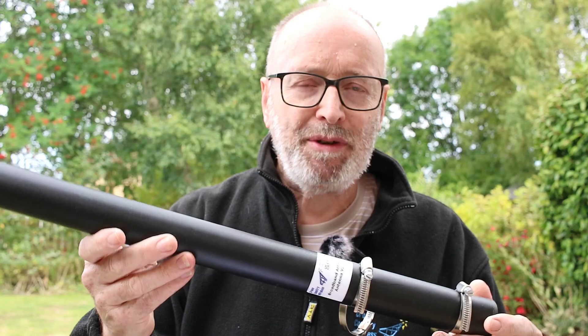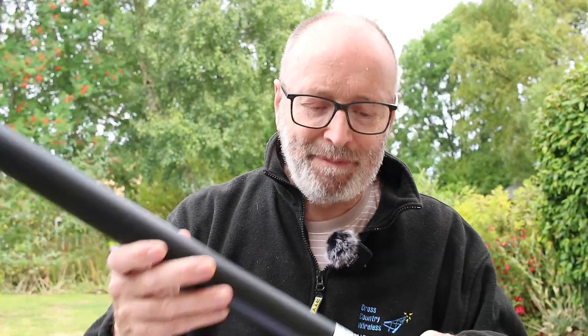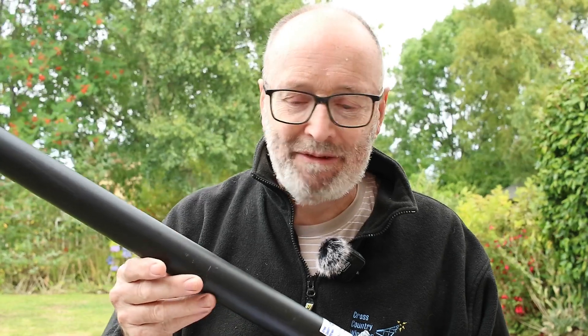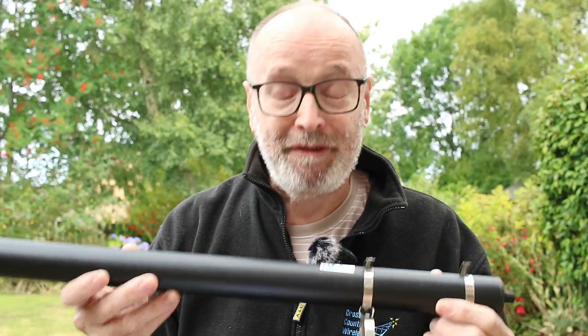It typically covers from 200 kHz to 1100 MHz. It will go higher than that but we can't guarantee the radiation pattern — it tends to get a little away from the horizon. Above the label is a linearly loaded fan dipole. This works as a multi-band antenna on VHF and UHF. On LF and HF it acts as a short dipole, a short electric field antenna.